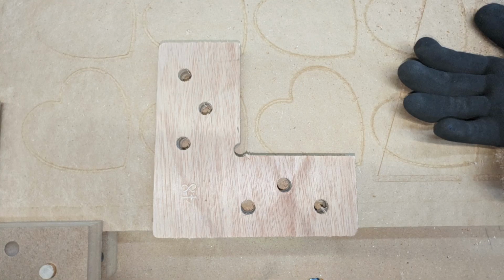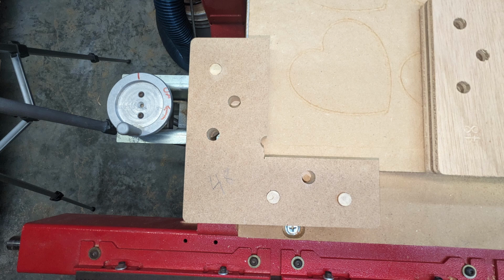This is one of the first stop blocks I cut for the machine. Unfortunately, a few weeks ago I forgot to shut my machine off at the switch before I shut the breaker off and lost the original origin point. When I created a new origin point, I had my surfacing bit in, so I decided to set the offset up so I wouldn't have to change the origin point to surface the spoil board, which is why the corner is not relieved in the correct spot on the stop block for the corner of the plywood.